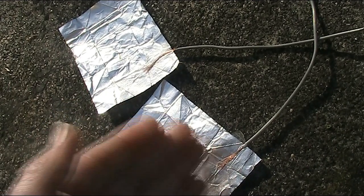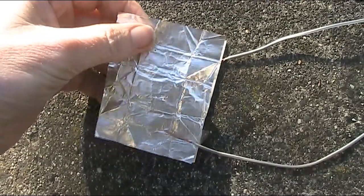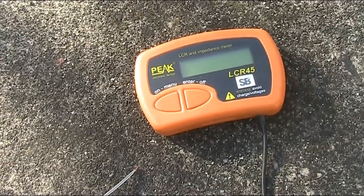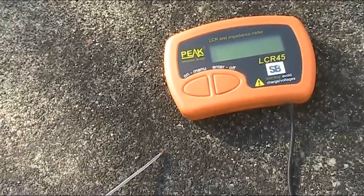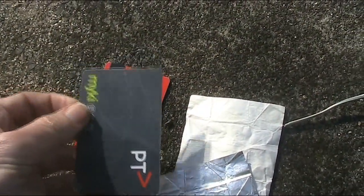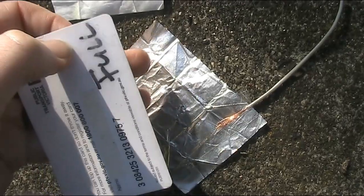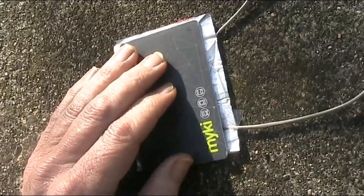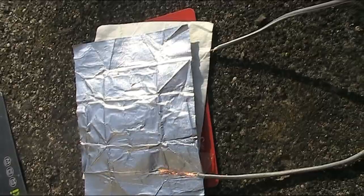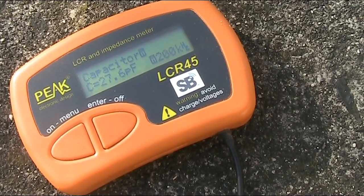I now have a wire on each of the plates — not soldered, just taped. Now we'll put the plates over and press with this capacitance indicator to see how much capacitance we get. I'll just use some credit cards to provide a firmer compression effect. Right now I've got no pressure, but the plates are overlapping — 27 picofarad.